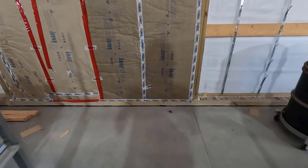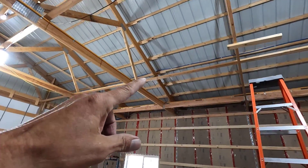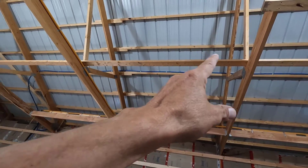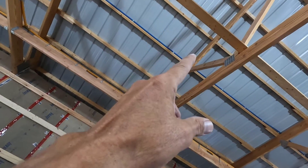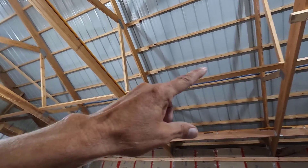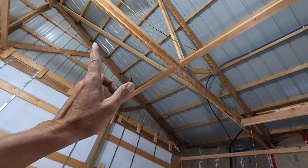I have this pull completely figured out. What I'm going to do is pull from right here, put my coil there, come up over this, and then over all of these up until this brace right here. What I'm going to have to do is put some blocking right here, here, and possibly down there so the wire doesn't fall off while I'm pulling it. I have part of the truss there on the back side to keep it there, so I need three more blocking here, but I'll continue to pull it across. I may need some blocking for this as well, but I'll figure that out later.